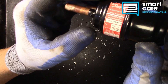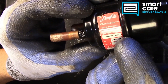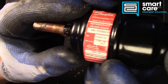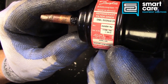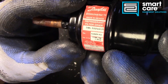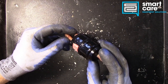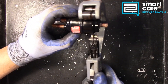You can see it's got a few things on the label here. It's got some basic measurements about the body size, and then it's got the volume that can flow through on the inlet, and down at the bottom there it tells you which refrigerants it's able to work with — in this case HCFC or HFC, which would be hydrochlorofluorocarbons or hydrofluorocarbons. It's got some pressure ratings for the maximum working pressure. Remember this is on the high pressure side, and it can only be fed liquid.